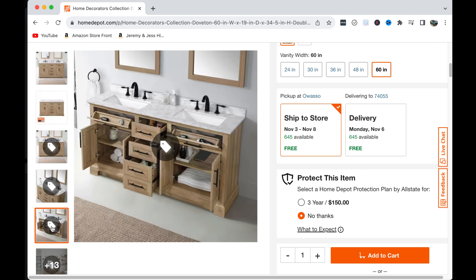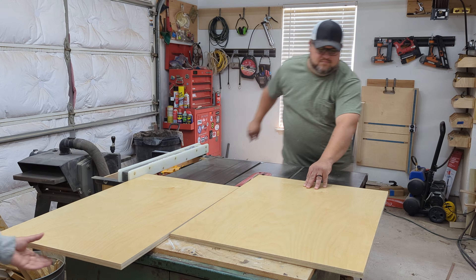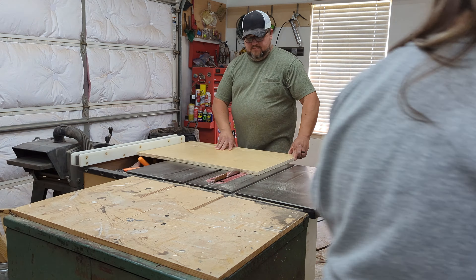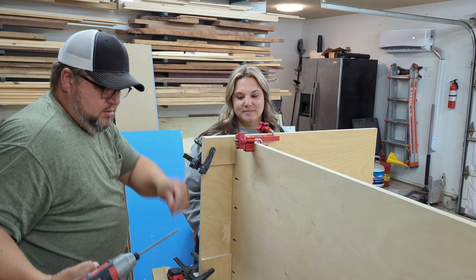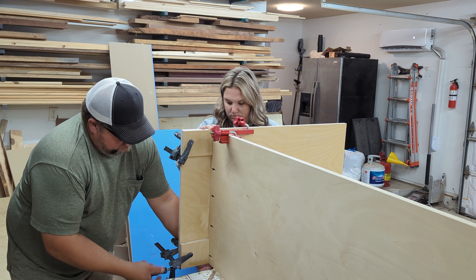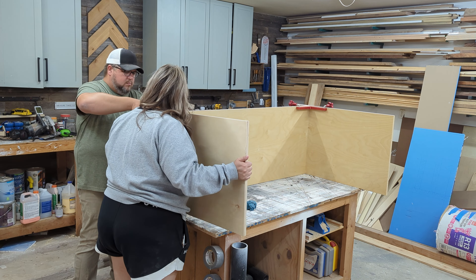The construction of this cabinet is very simple. We use three-quarter cabinet grade plywood, pre-finished on one side, which I love for cabinet interiors. The two end panels are the same size so we cut both at the same time. The two inside dividers are also the same size, so we do the same thing. For joinery we use pocket screws and glue. We start by attaching the sides to the bottom of the cabinet, then come up high enough for the toe kick. I've clamped a couple of small spacer blocks in place to give me a good measurement for that height off the bottom.